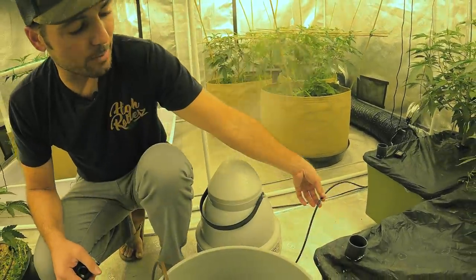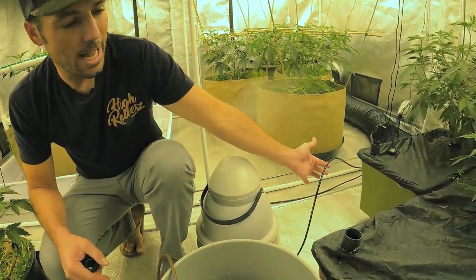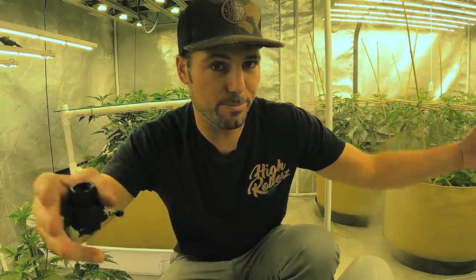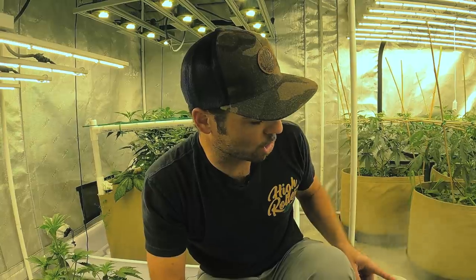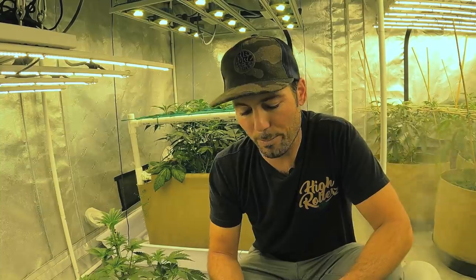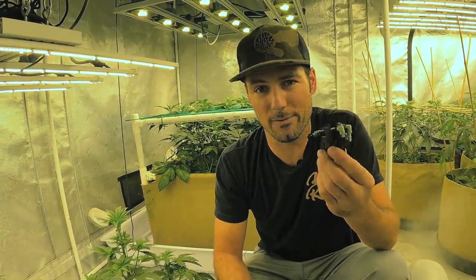It comes out the bottom and it goes through this water tube that's right here, and it's got a float valve in there. The gravity of this big trash can of water is pushing down and trying to drain. It drains into here until the float valve shuts it off, until it calls for more water based on the environmental controls. In that same one, we have out the top of the container, which I'll show you, a hose connected to an ACE submersible pump. We'll be pumping the water to this head whenever I need it.